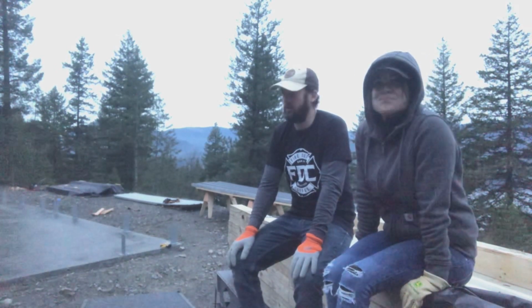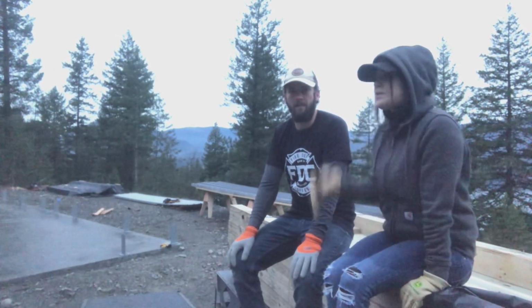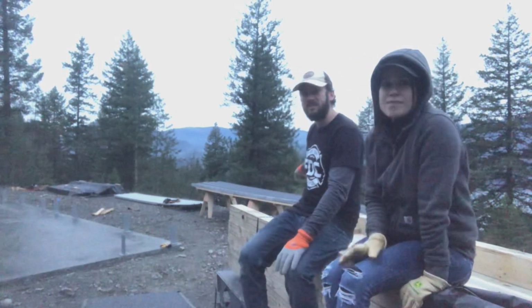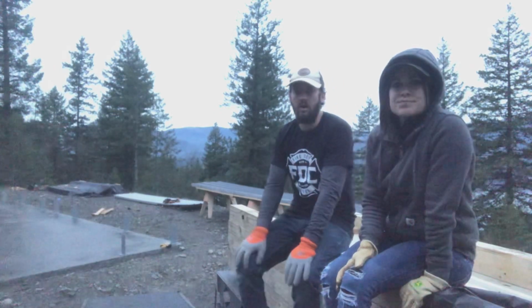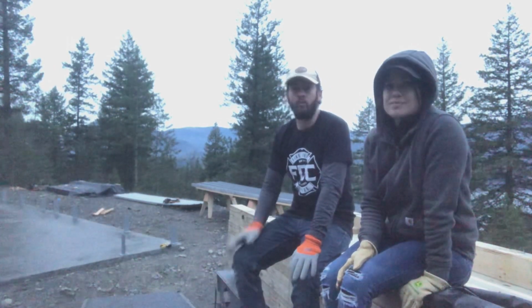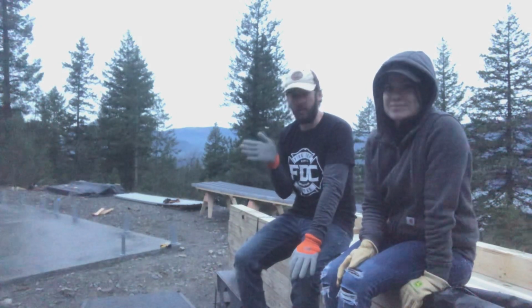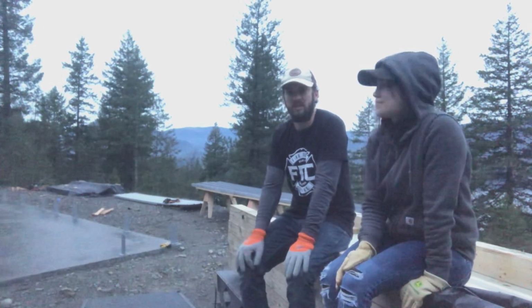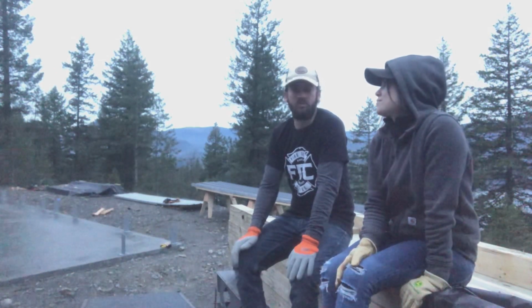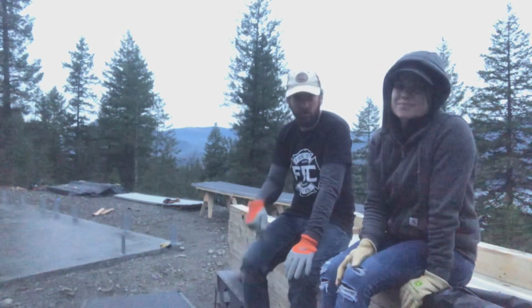We had to pretty much unload everything piece by piece, which is not really a big deal. And we took advantage of it too. I don't know if you could see behind me, but we got the roof steel up on some sawhorses right now. As we unloaded it, we lined it up so it was perfectly flush at the eave end. We'll save some time back because we're gonna pre-drill all the holes, so we'll just go straight through all of it as we drill. Hopefully we can recover some of the time that we spent unloading it one at a time.